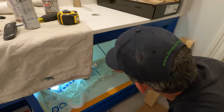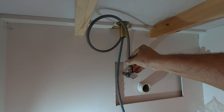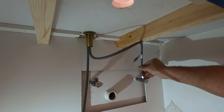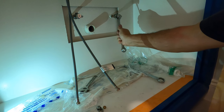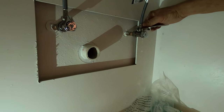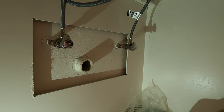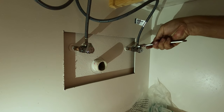Now let's hook up the supply lines. Most people just leave the valves pointed straight up — but actually that kind of works. It naturally bends and stays out of the way. And no pipe dope on this — it's a compression fitting and you don't need any kind of sealant. I'm going to tighten these up before I forget. Let's purge the lines with our clean bucket. How can that be leaking? I guess I just have to tighten it more. Had it tight and still leaking — there we go. The faucet's all done.